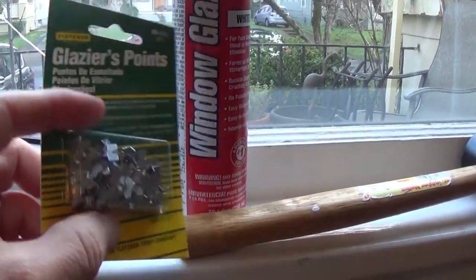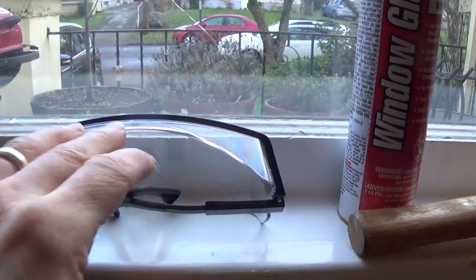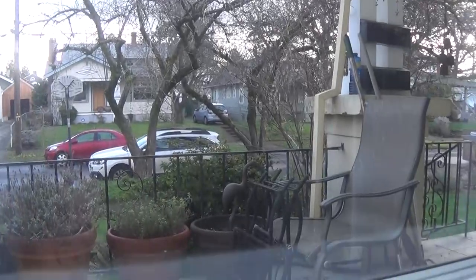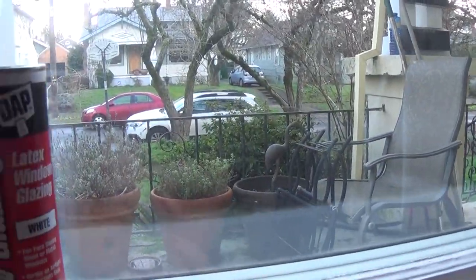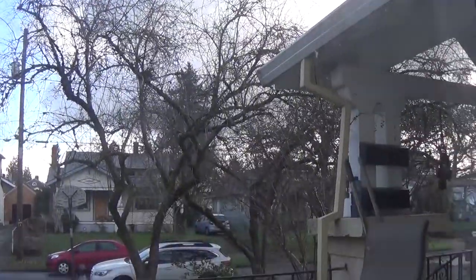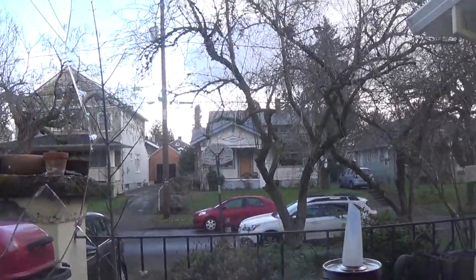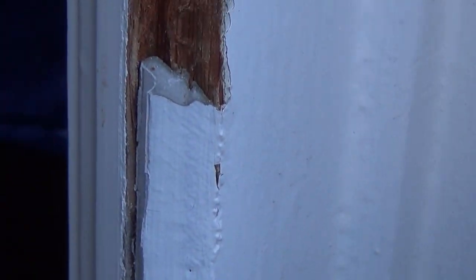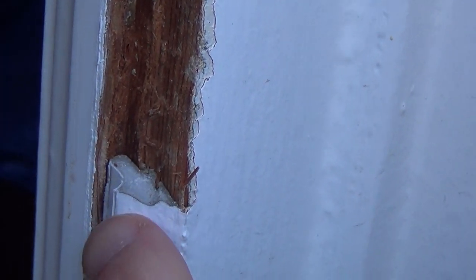Before you apply the glazing, you do need to hold the glass in place, and you can get yourself some points — there are a couple of different kinds. I just got these standard points here. I also have some eyewear and a putty knife to clean things up, some gloves, and I'm going to use a rubber mallet to bash out this old glass. I'm going to tape up the window with some painter's tape to prevent large panes from falling, and put some tarps down to keep things clean. First, let's get rid of this storm window. On the other side you can see how the glazing works — it's a hardened material that holds the window in, grooved in where the window pane was. You can apply it with a putty knife or in this case I'll use a tube.